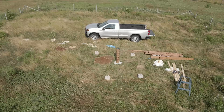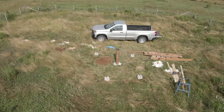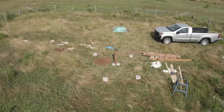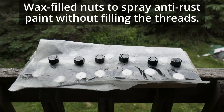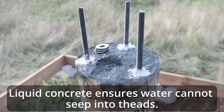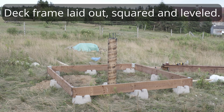I don't plan to dig out under the deck footings or put in concrete and whatnot. The main reason is I've built other camps and sheds on my land here and I'm very familiar with this ground. That soil is only a couple centimeters deep until you begin to hit gravel and rock, and the soil itself is very hard packed — probably from training one-ton horses on it for so long. I'm pretty sure if I were to dig out the ground and place gravel, I would just be creating a place for snowmelt to catch. This ground is hard; it'll hold the corners of the observatory perfectly, and the structure is small enough that I can shim it up back to level should the ground ever shift.